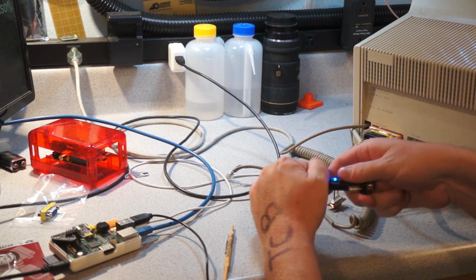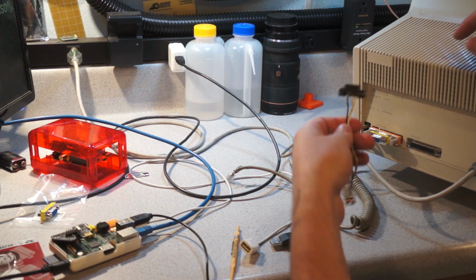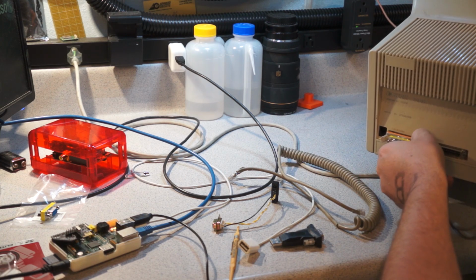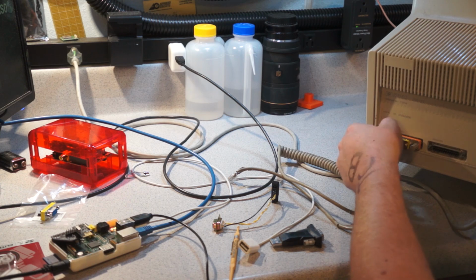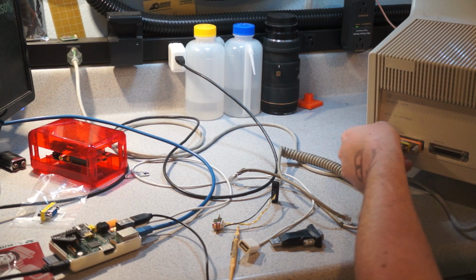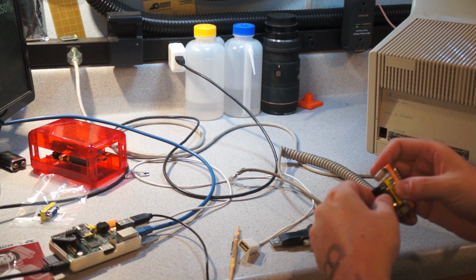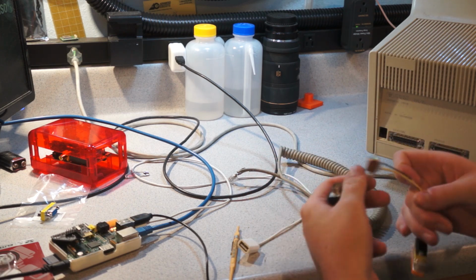That's basically just swapping the TX and RX lines over. And then there's, of course, because annoying, it has to use DB25 for serial. So we have a DB25 to DB9, and then there's a DB9 gender changer, and then we have the null modem cable, which then goes into the USB serial interface.